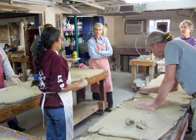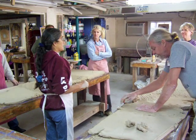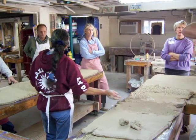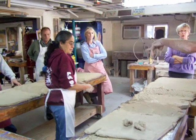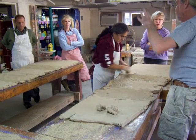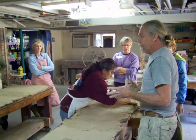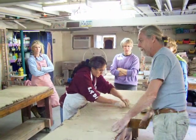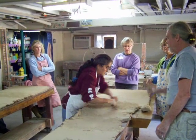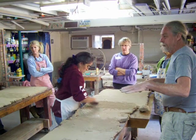When the clay has a lot of sodium silicate and you put in a little water, one second it's very liquid. That's the whole idea with casting slip. Xenia converted my local clay to casting slip — she had the formula down, weighed everything out, and I mixed it up with a drill. It was really thick in a five-gallon bucket and I said this isn't going to work for casting, it's way too thick.